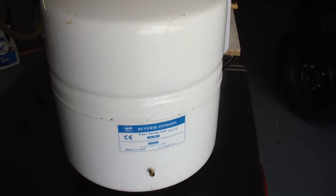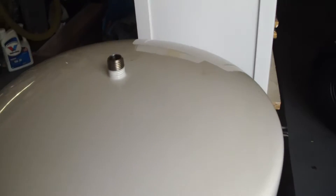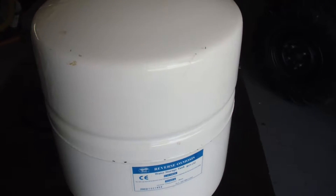First I'm going to take a bore scope and look down this hole to see what it shows us, then I'm going to cut it open and we'll see what the inside looks like. If it's clean, like I'm suspecting it will be, that to me is evidence that the reverse osmosis water filter setup actually works. The system I've got is five-stage: the first stage is a sediment filter, then two carbon filters, then the actual reverse osmosis membrane, and then another carbon filter after that — five total filters.